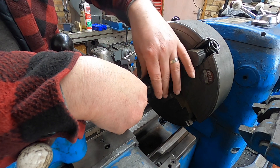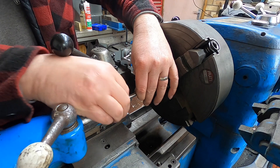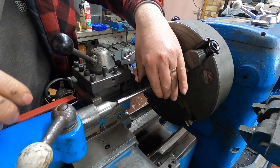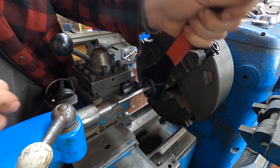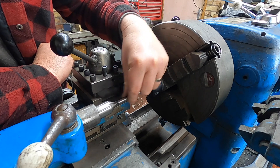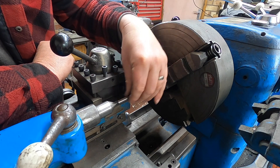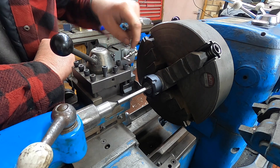I've done it a bit close. So I'll bring that up to the spigot. What I do notice when you use one of these collet blocks is it's less likely to mark the metal. Whereas trying to grip something small in a chuck I always find that you end up getting marks in. These have an advantage because they grip further around the material.